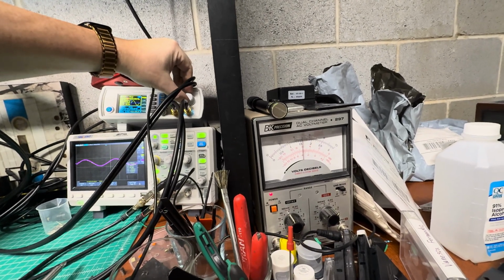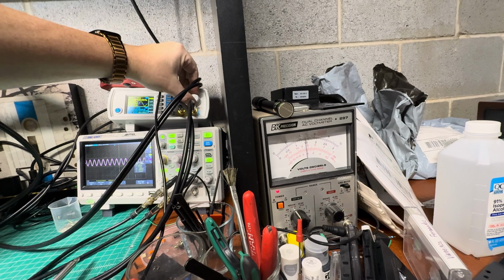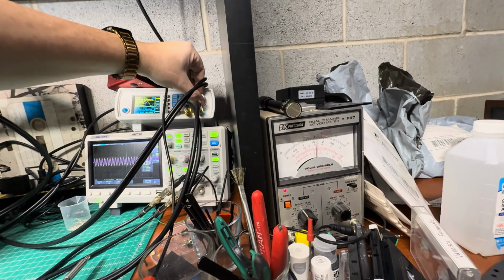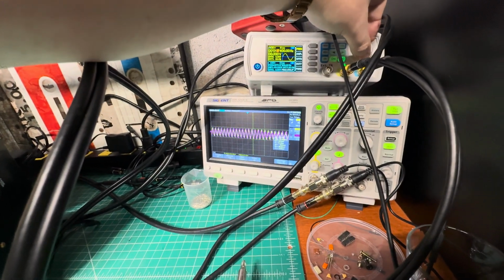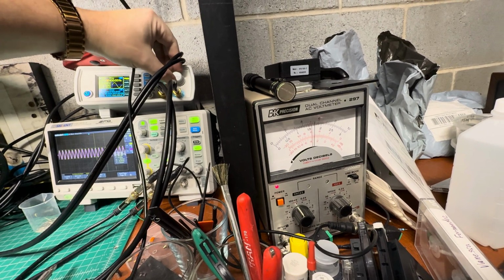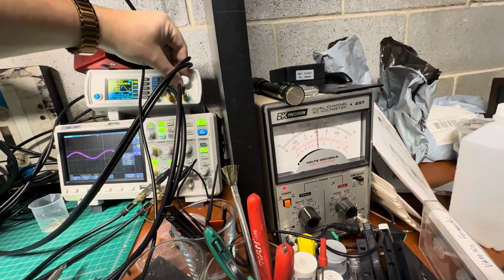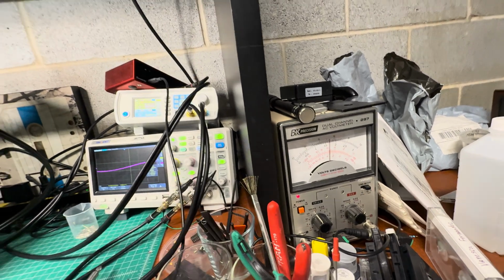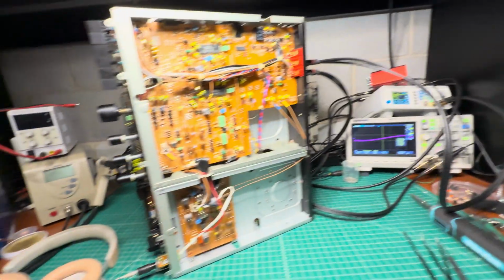400 Hz, 1000, minus 1 decibel, 2, 3, 4, 5, 6, 7, 8, 9, 10, 11, 12, 13, 14, 15, 15.4, 16, 17, 17.4, we're still recording, 18, it started to drop, 18.4, so up to 18 kilohertz on type 1 tape, and it's pretty linear, you see, just plus 1 decibel below 1 kilohertz. Interesting results. Okay.